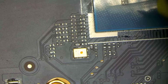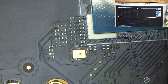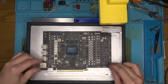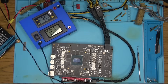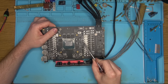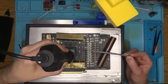No detect is likely caused by the lack of connection at the bottom of the left corner of the GPU die. As proof, the oscillator does not generate anything because it is not connected to the core. The right thing to do at this point, given the circumstances, is to throw it away and move on. But I don't have a life, so I'll just keep trying again, and who knows, maybe I'll get lucky. After trying yet another time, the result is — it's now complaining about the two chips on the top right corner, so I guess that area is also not sitting high enough.